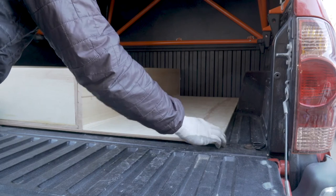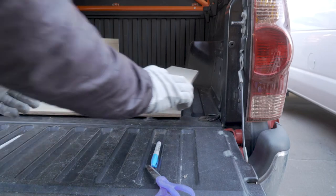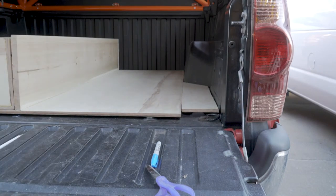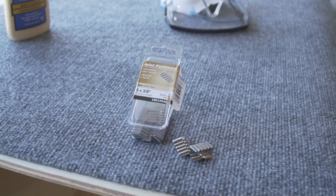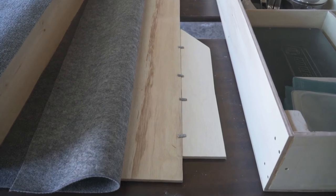When laying the big baseboard in the truck it would wiggle side to side a little bit, so I knew I was going to need to add another piece of plywood to fit the wheel well shape to help stabilize it in the truck bed. It would also help extend the base floor for a more cohesive unit to stand on when inside the camper. I didn't have a great solution for connecting these two plywood pieces, so I just did the best I could with wood glue and corrugated joiners — it eventually got covered with carpet so I wasn't too worried about making this part look pretty.